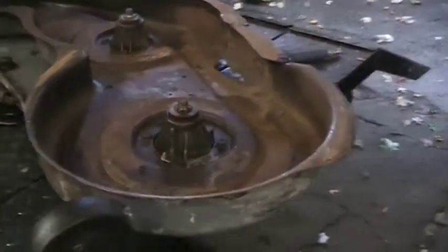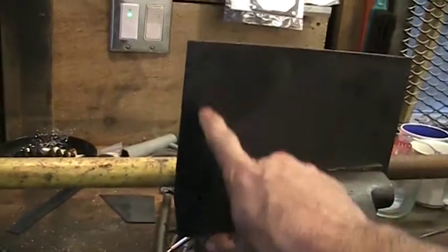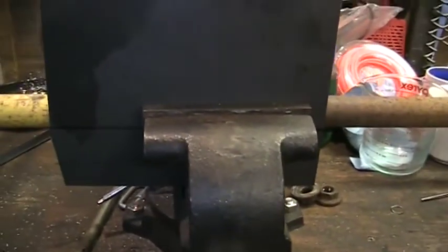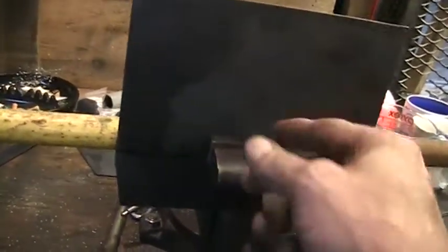I got the front patch welded on — looks alright. We're dealing with some pretty cruddy material. I flipped it over, got it scraped a little, but it was too dried so I took it outside and pressure washed the hell out of it. Nice and clean now — a little surface rust, not too bad. To fix this hole, I've got a piece of one-inch solid round bar and a five-inch line that I want the width of the patch to be. I'm going to heat this up, maybe lift it a little so it curves earlier, and use a mallet to persuade it over.